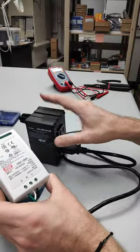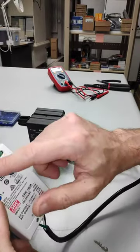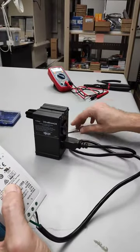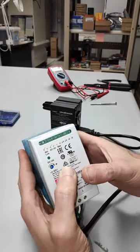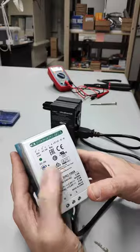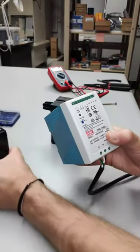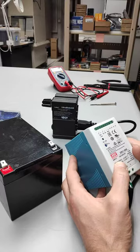You do want to have that surge suppression on the AC line before we come into the universal power supply. Surge suppression first, then we bring in — in our case — the 110 volts for the USA. We're going to output that as about 12, 13, or 14 volts; you can actually adjust it a little bit. Two wires go off to the battery, both to trickle charge the battery and for backup. Then we're going to make some wires that go out to the control board. Battery wires will be right here, voltage out will be right here at 12 volts. Let's go ahead and make some wires that hook the universal power supply up to the 12 volt battery so we can get a test and see that it's working.